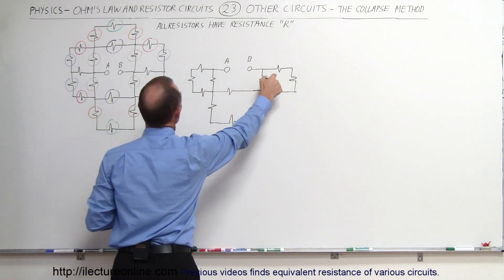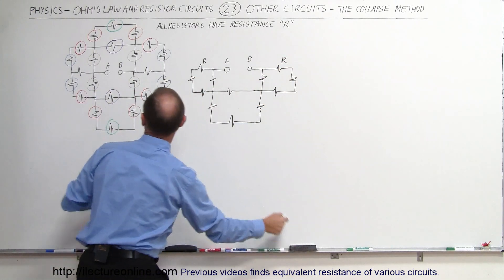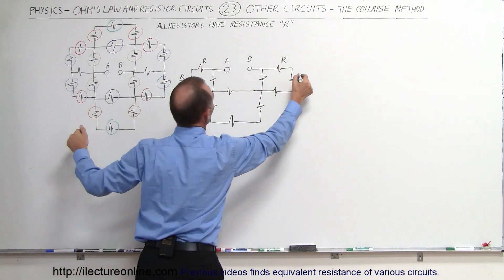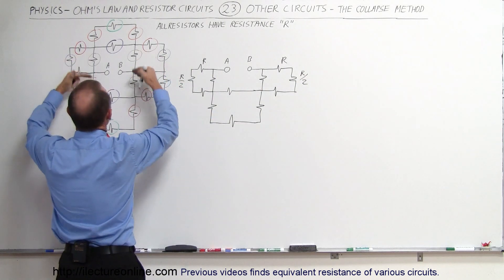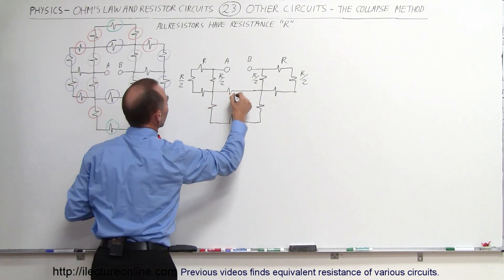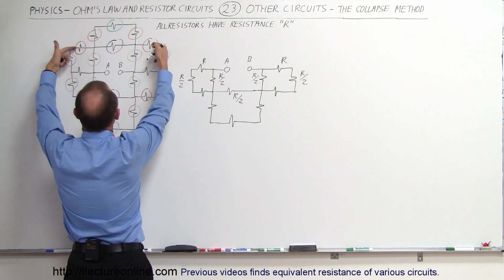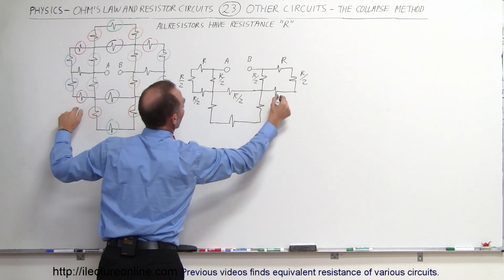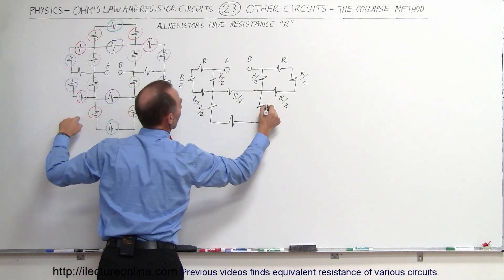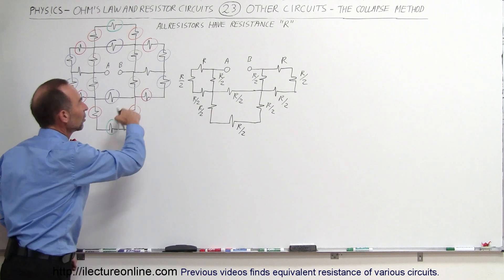Notice that these two resistors are still the same, so they have resistance R and R — these are the blue resistors. The two resistors collapse together, so this is R/2 and this is R/2. Then the two brown ones connect together: R/2 and R/2. Then the purple ones connect together: R/2. The two red ones connect together down to here: R/2 and R/2. The orange ones connect together: R/2 and R/2. And then the green ones connect together: R/2.